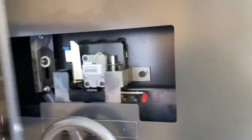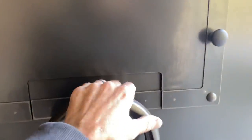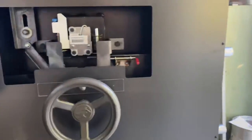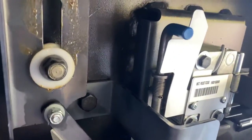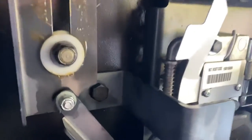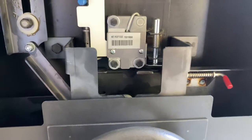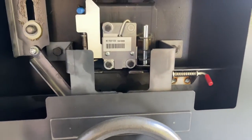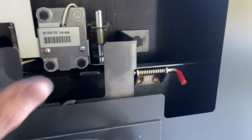Inside here, this does have a panic room option. So let's say we jump in the room and pull the door shut — we can roll the bolts. And then if we just bend this little tab back and throw that pin to the right, it drops down into a locking hole there. To get back out, you just reset it. So that's how quick you can get into your panic room, roll the bolts, drop this little pin into place, and then even if the bad guys know your combination on the outside, they still can't get in.